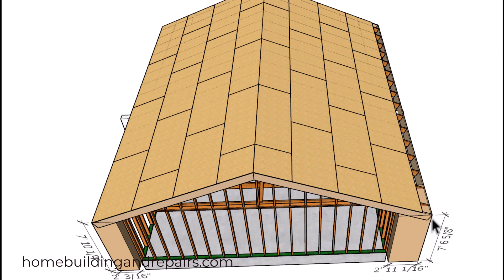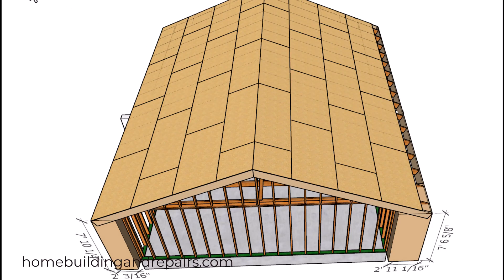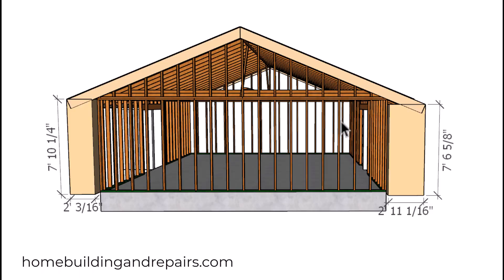Let's go ahead and make this part of the roof overhang about a foot longer. I left the roof sheathing the same size on both sides, except it's about 12 inches longer on this side. You can see down here where I drew a couple of example boxes to give you an idea of how the measurement in the height is going to change.